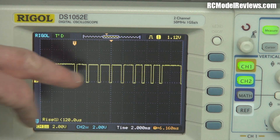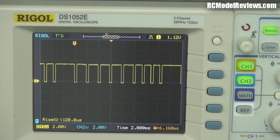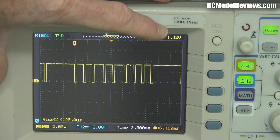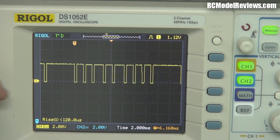I'm only using five channels; these other pulses here aren't used at the moment, they're set to a medium level. If all pulses were as wide as they could be, the sync pulse would effectively just become another pulse and the gear plugged into your receiver wouldn't know how to start numbering the channels. That's why with FrSky receivers this can be a problem — you sometimes have to reflash them with software that enables a longer total frame length, so you can have all channels at full width without losing the uniqueness of your sync pulse.